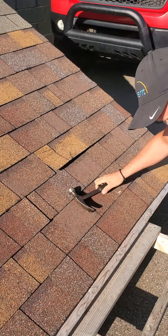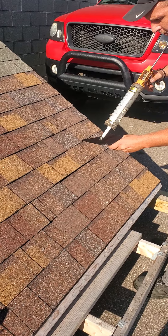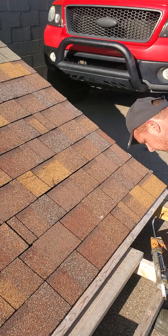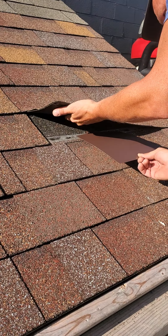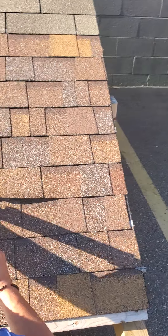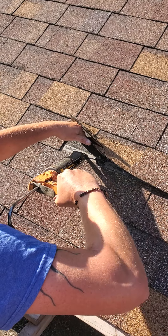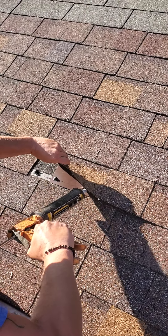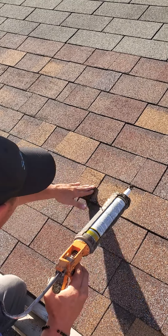Now that we've got our little rip here, we're going to put a flash card there. Put a little bit of caulking there. You want to make sure that you're clear underneath with your nails. Slide that underneath to cover your nails. You might want to put a little bit of caulking on the nails themselves, and any nails that are right around seams. Put that down — a little dab of caulk just to hold your shingles down. Now that seam's protected; it's not going to leak.